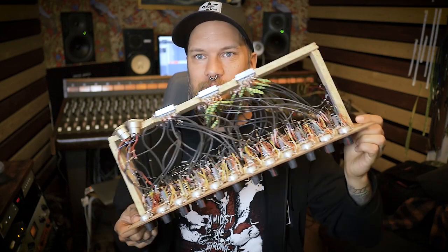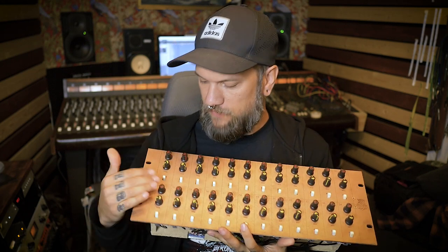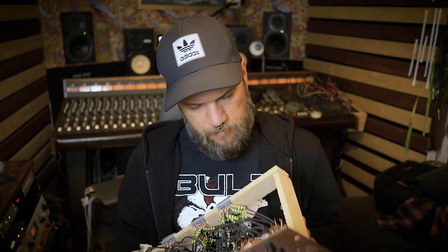What we have is a total mess, but it's working. What I was doing: I had 24 channels with fader and pan, and I could route whether I wanted the signal to go through the monitor mixer or directly through the mixing console. I don't have a diagram or schematic on this one. I found the passive summing mixer schematics on — I think it was diyrecordingequipment.com. So if you just Google 'DIY passive summing mixer,' you will find what you're looking for, and then you just have to work away from there to make it do what you want.